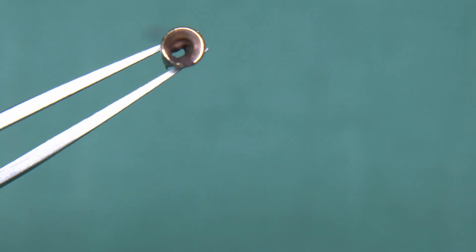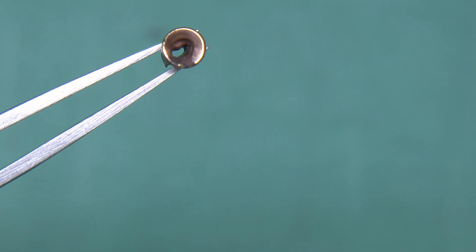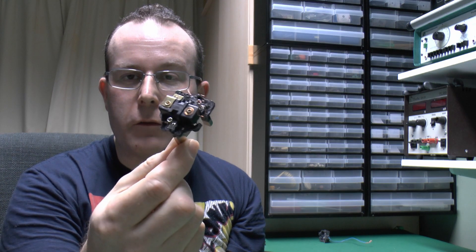The cup is completely wide open — you can see straight through to the bench below — and the crimp indentation in the side is extremely slight. I thought somebody went at it with a pair of pliers rather than the proper crimping machine. So that's the story of that horrible plug, which turned out to be not the wire breaking — the wire wasn't even attached to the terminal properly in the first place, so hardly surprising it failed after a fairly short time. That vacuum cleaner was only about 18 months old, so I certainly would expect it to last longer than that. The vacuum cleaner's been repaired, just has a new plug put on it — that was an easy fix.